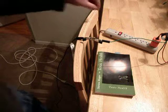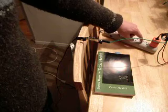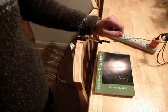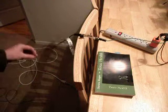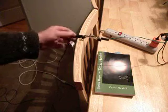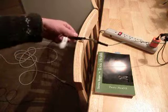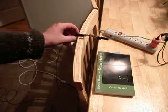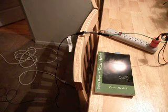Right now, we have the electrical system in the house. This power strip is hooked into it, and the ground pin is this top round pin on the power strip, and that grounds all your appliances in the house. It's become popular to come into contact with grounding systems for human health reasons. I currently don't recommend that people, in America at least, come into contact with their grounding systems, because it does actually connect into the neutral connection of the utility transformer in America. That particular connection may have an AC voltage on it, and it may also have some very high frequency energy content to it.